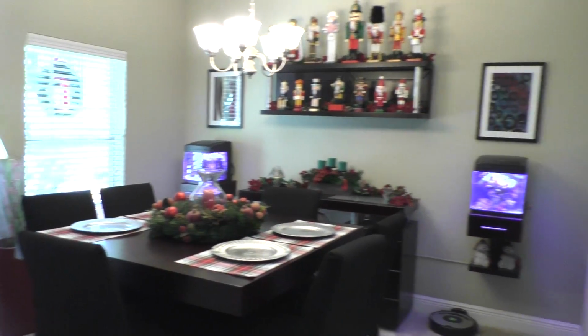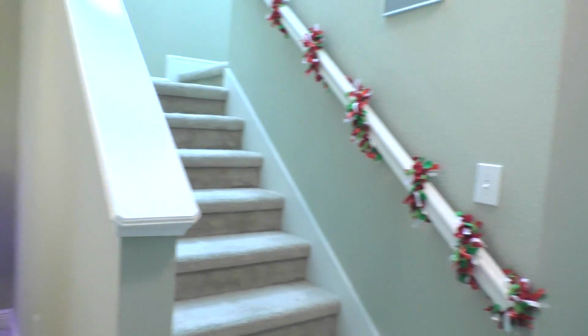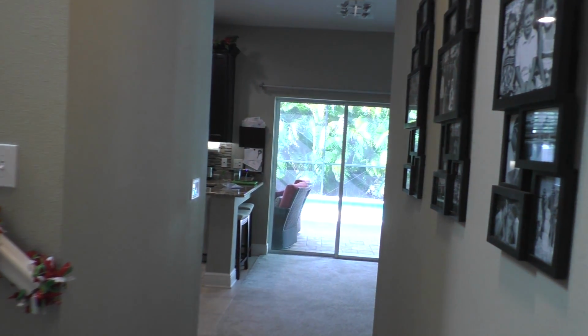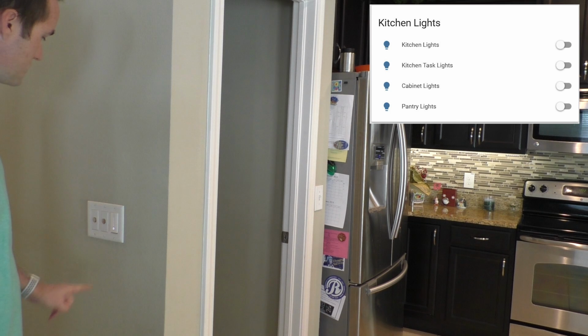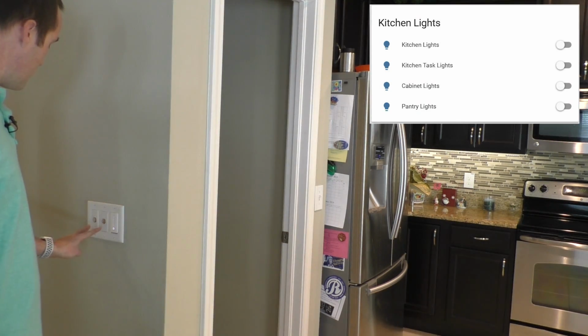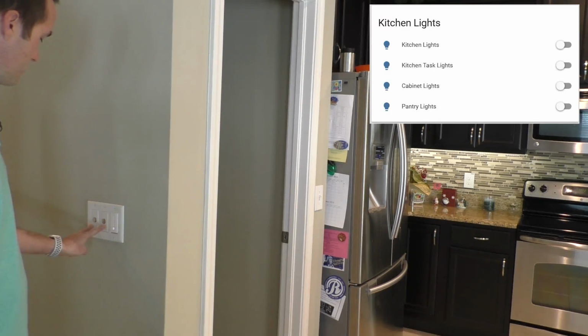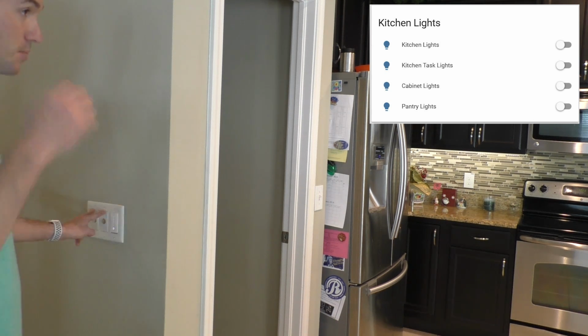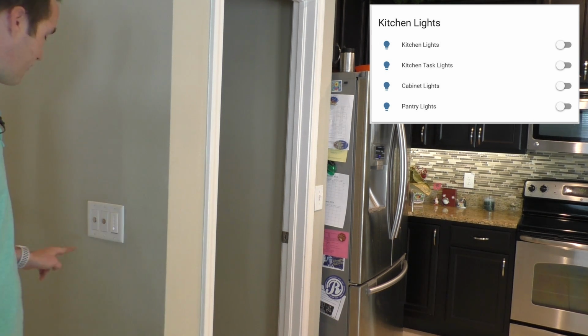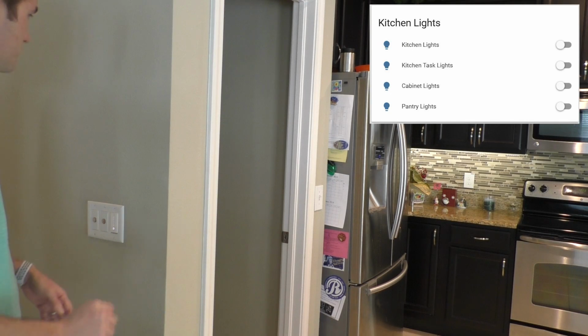Moving on to the kitchen. First thing in the kitchen you can see is a Wemo brand dimmer that I haven't replaced yet. I do intend on replacing this with a Tasmota dimmer, but I haven't done it yet. Then I've got two push-button momentary switches that are mounted to Decora plates here. And these momentary push buttons are linked to Sonoffs. There's still Sonoffs back there. Despite my love for Shelly, I haven't converted everything over from Sonoff to Shelly yet.